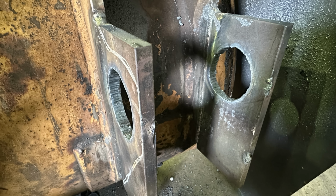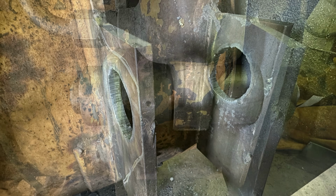Now it's a good idea to leave these a little bit small and use a carbide burr to round them out a little bit in order to get them to fit. These I almost made a little bit oversized because I couldn't really carbide burr them much without losing the tight fit, but luckily they welded out okay, and I stick welded these. I wasn't too worried about the strength or having perfect welds on that. The key stress member were the plates to the bucket themselves.